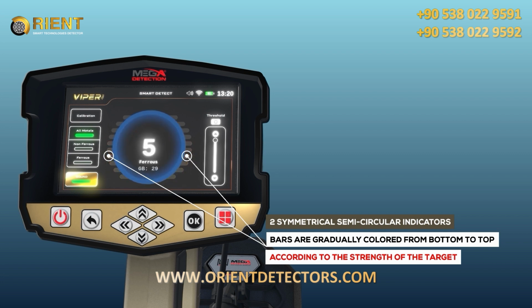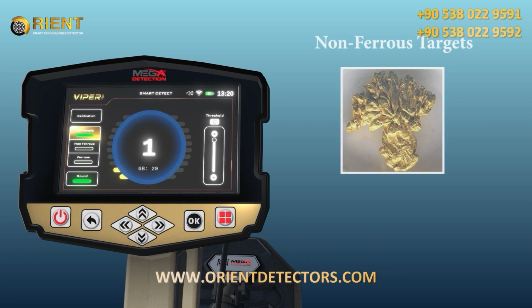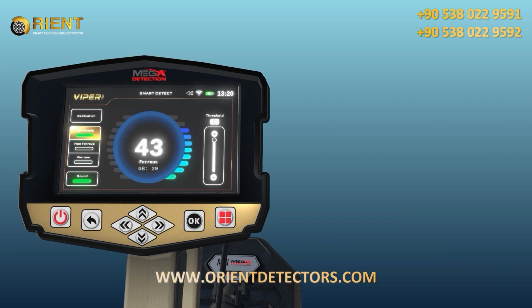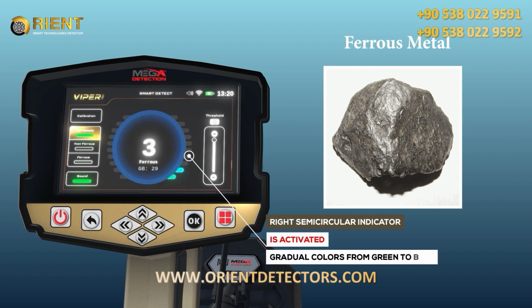They are shown in graduating colors from bottom to top, according to the strength of the object signal and the selected detection mode. In the all-metal detection mode, if the target is non-ferrous or precious metal, such as gold, the left semicircular indicator is activated and is shown in graduated colors from yellow to red. A ferrous target will activate only the right indicator, and the color gradient is from green to blue.